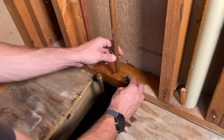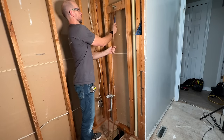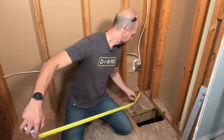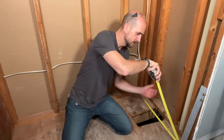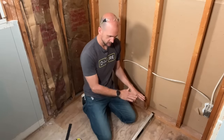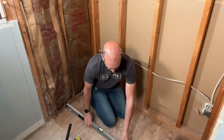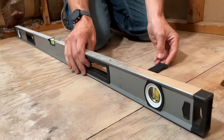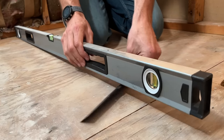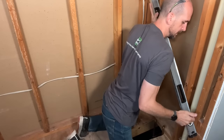With the main water shut off, I'm cutting the lines and putting on half-inch SharkBite caps, which are super handy so you can turn the water back on to your house while keeping these capped without any leaks. Then I'll remove the old copper. Before confirming my measurements, I have 60 and one-eighth of an inch, which gives me a five-foot tub, and a 32-inch width to accommodate my Delta 400 series acrylic tub. I'm making sure I'm ready to place the tub by checking the subfloor side to side for level with a four-foot bubble level and then front to back. Side to side was looking good, but front to back it's sloping down towards the drain side by about one-eighth of an inch — right on the borderline — so I'll put it in place and see how everything lines up.